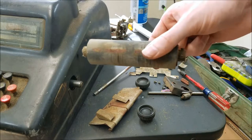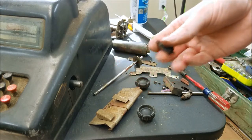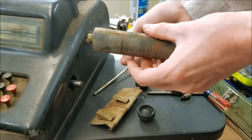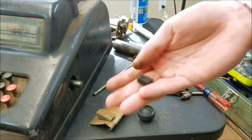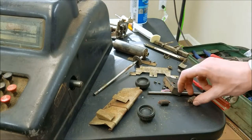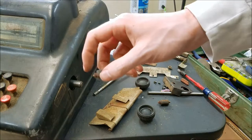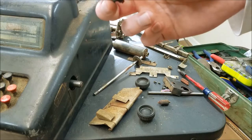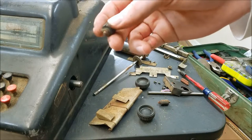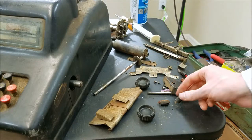So we're definitely going to have to clean this up — you can see it's pretty bad. These might be a problem. These are little rollers that go down at the bottom here so that they wrap your paper around the bottom. You can see they're pretty unhappy. There's a split down the side. So I'm going to try and clean some of the rust off of these shafts, and also see if I can try some lacquer thinner or something to soften the rubber up a little bit. I don't expect it to close these gaps though, so I'll have to see if that's going to be a problem.